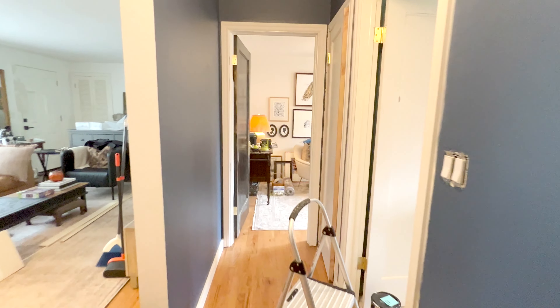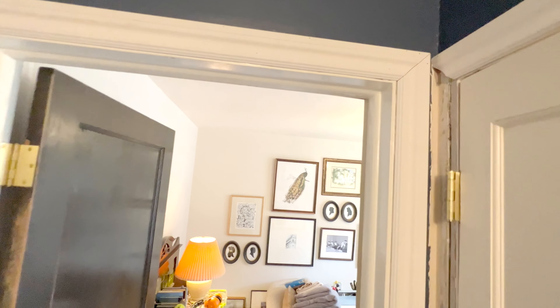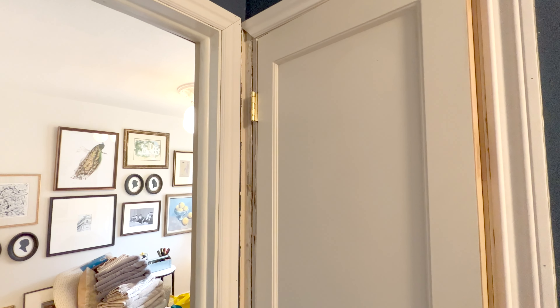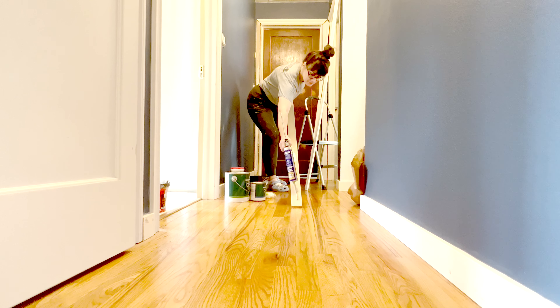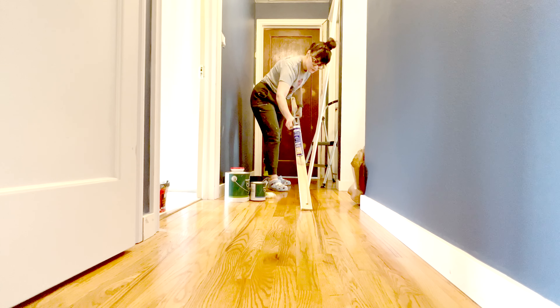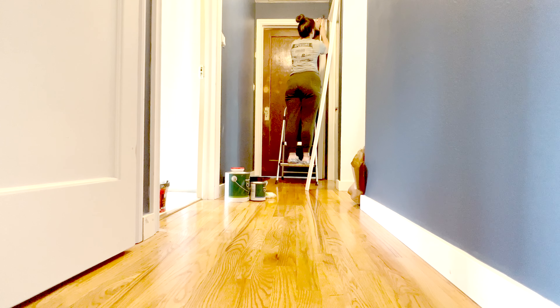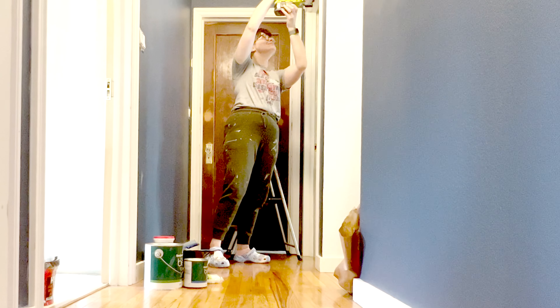Back in the hallway — to some of you this might seem like a really subtle change but to me it's everything. This particular edge trim for the door casing on the linen closet is narrower than the rest, so I'll have to use my in-laws' table saw to trim it down so that it fits. After cutting the vertical pieces of the door casings with my miter saw in the wood shop, it's time to secure them in place. First I run a length of liquid nails heavy duty along the wood trim before affixing it to the wall. Liquid nails does have a little bit of a drying time which makes it sort of movable as you ensure that it's level before securing it in place with your brad nailer.